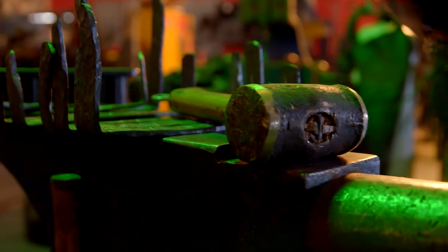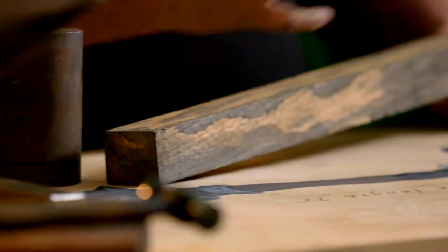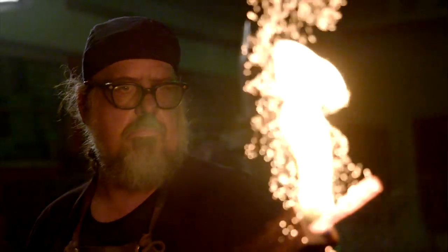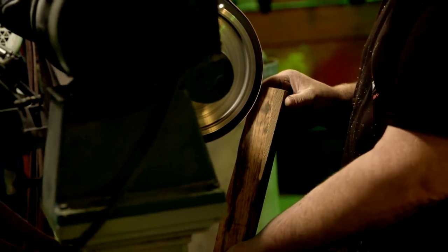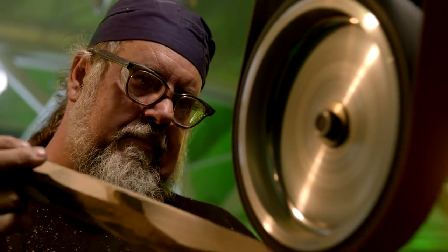For the handle, the Doomhammer will be made out of a solid chunk of oak. I'll drill a hole through the end and put a piece of five-eighths all-thread through the middle of it, because if it was just plain wood it would snap immediately. The ends never meet exactly in the middle, so I'm going to heat up a poker in the forge and push that through. After I've drilled and burned the hole, I take it over to the belt grinder and give it a rough-hewn appearance. I'm trying to achieve the look of this handle being created with a knife or an axe, but I'm doing this with an abrasive belt.